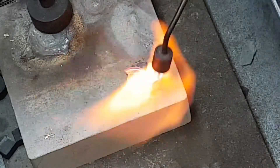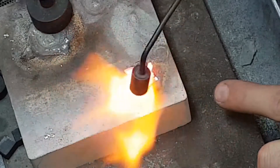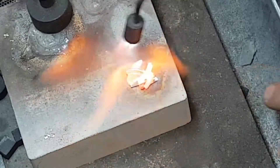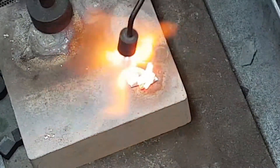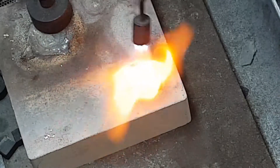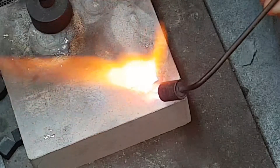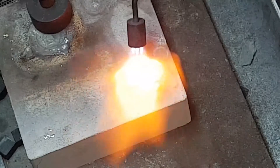I just want to heat it slowly — don't want to heat it too fast. I haven't preheated this crucible, because with such a high melting temperature, it's not really necessary. If you heat it slowly, the crucible will heat well and truly to the temperature it needs to be during the melt. If you preheat it before, you can overheat the crucible and burn the metal through.